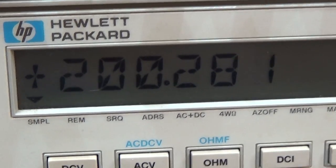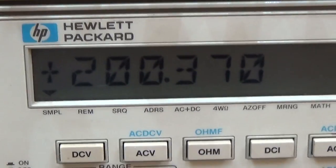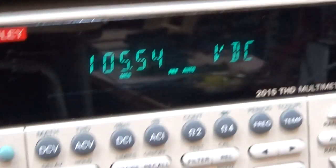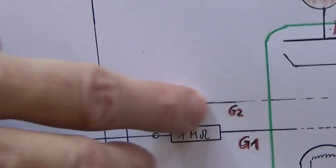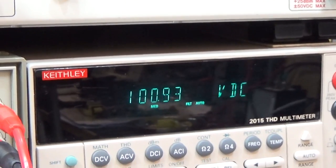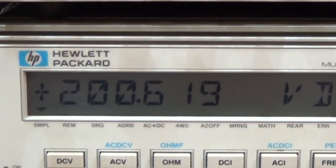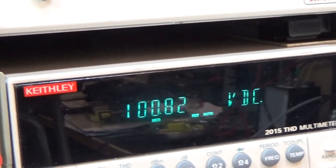Okay, so yeah. I mean, this is tube technique. So there it is — not one voltage that counts but anyway. This here is now 105 volt, so this is our screen voltage and we can adjust it with this guy here. And we want to set it to 100 volt, because that is our G2 voltage. So I would say this is good enough. So now we have 200 at the anode and 100 volt at G2.